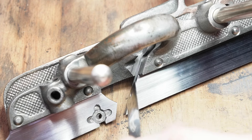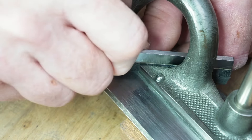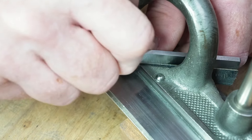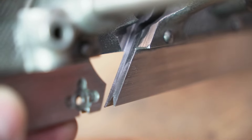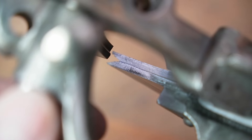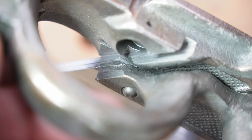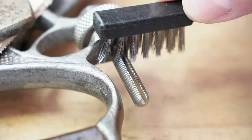I simply had no way of targeting sufficient pressure in that area, so I stopped and we'll just have to accept it as is. I did a little more work with both main parts locked together. The result is okay but it's not brilliant — keeping pressure on was really difficult, access was difficult, and I thought if I did any more I might make it co-planar in one place but not so much in the other. Those surfaces are a bit rough but I'll polish them later on when we finish up.